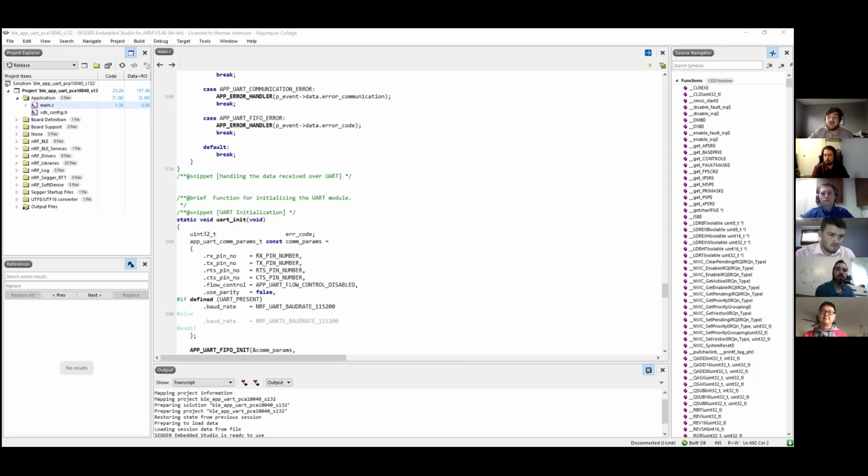So fortunately for us though, they do have a UART specific program. So we were able to actually take data from the microcontroller through UART and broadcast one channel through Bluetooth and actually get that channel on the Adafruit app, which we'll, spoiler alert, see later. So it was actually really good. So it ended up working nicely, but the code itself is very intense looking and very hard to read right off the bat, especially with our limited knowledge in programming.